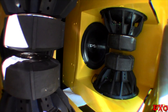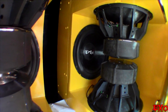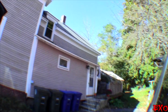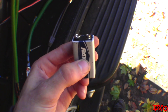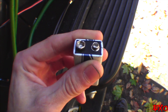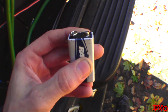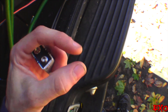All these questions hopefully are going to be answered in this video, and I'm going to take you through a foolproof way to test the phasing, and we're going to see at the end of the day what's going on with these as far as movement goes. Very simple — all you're going to need is a 9-volt battery and someone to help you out. We're going to take the positive and negative leads from our speakers coming up from the box, plug it into the positive and negative of this battery, and what that is going to do is give it a direct current — a DC signal — so it's only going to be able to move one way, giving us the opportunity to see which way our subwoofers are going. That way, it gives us a full view to see if anything's moving in the opposite direction.